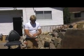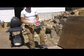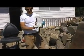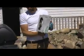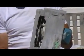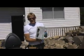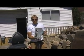wall section. What we're going to be doing is we're taking a circular saw with a Freud thin kerf blade. We're going to be slicing into the plywood. If you rent concrete forms, they will be routered out. They use a very small router bit to router out the plywood itself. However, this is a fast, easy way to do it. It works very effectively.